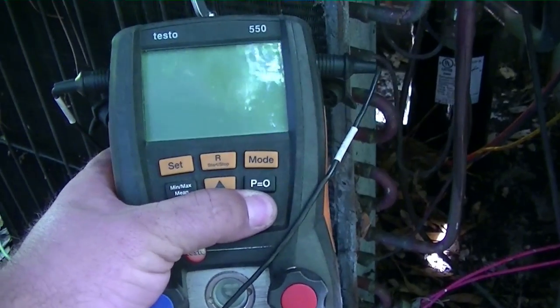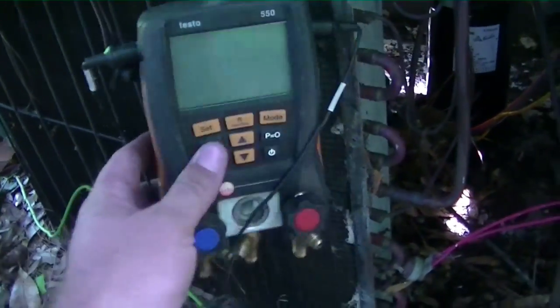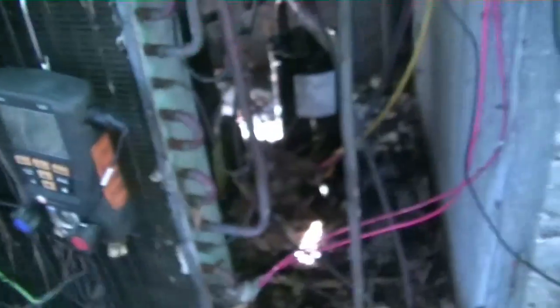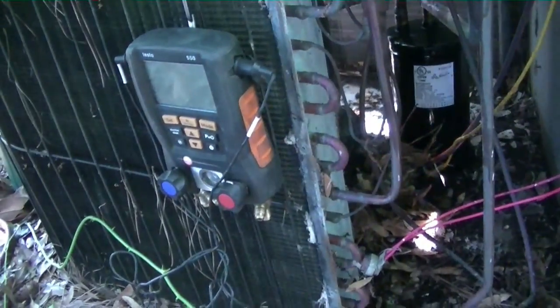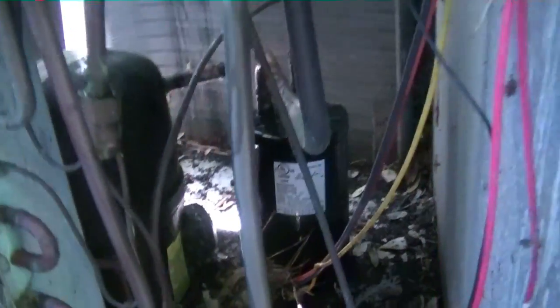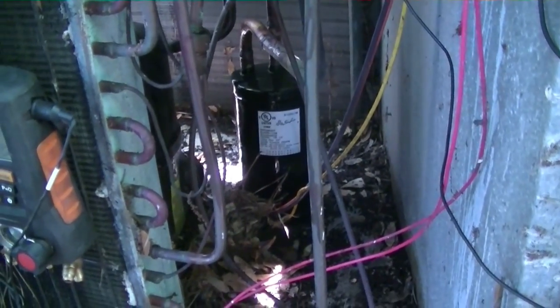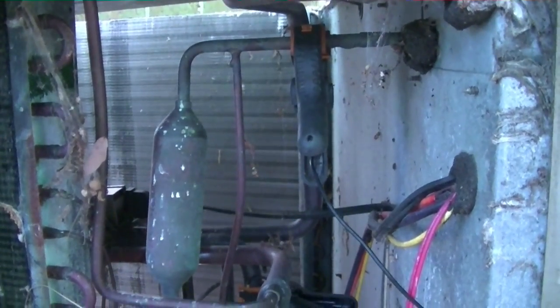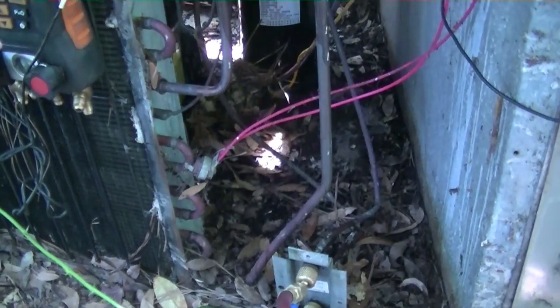Alright guys, we're letting the pressure off over here. I was going to use my Testo 550s and they won't come on. I looked in the back of the battery compartment and I see on the screw there's a little bit of corrosion. So I'm going to have to open it up and take a look — looks like they're going to have to be fixed. Very sad. I'm sure glad I had these. And there's our accumulator in place. Not as firm as it normally would be because the base is kind of rotted out at the bottom where it mounts. I put 325 pounds of pressure on it — at first I thought I saw a little bit of a leak, but it was not. I redid the tightness test and it's good to go.